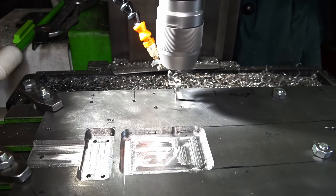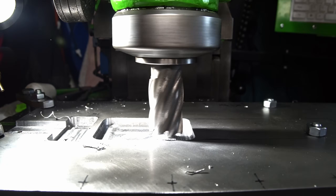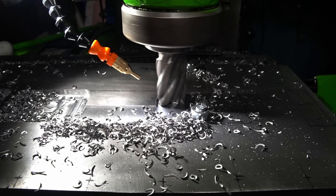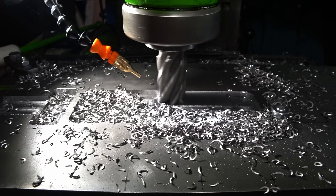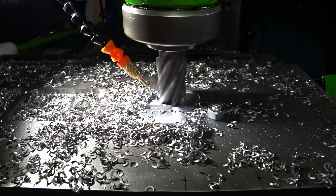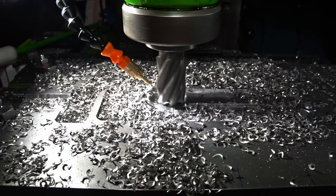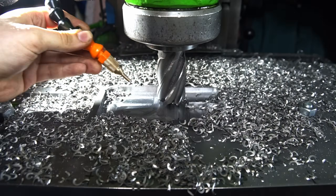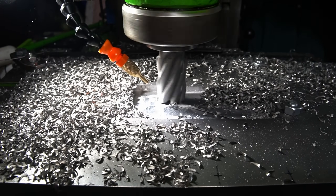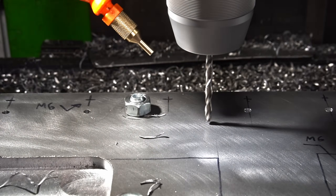Second work setup and the first holes. The bigger the end mill, the more satisfaction during the machining. The chips are flying lovely with the steel. And the third setup — each time I base on the sidewall in the Y-axis and hole centers in the X-axis.